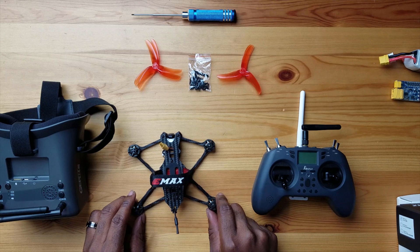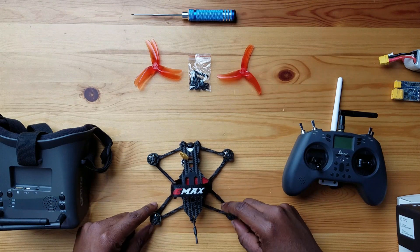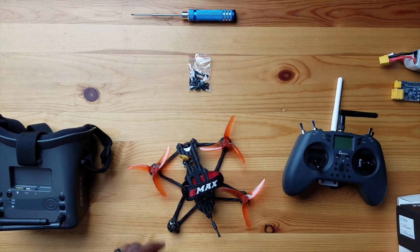Back from the computer at the desk — drone, goggles, and radio are all set up. Setup was pretty simple with some gotchas, and the VTX threw me for a loop. I'll look at that shortly. Now for the props — as you saw in Betaflight these are a props-in configuration, so the motors spin inward toward the frame. Setting all four propellers up for that now — front-left inward, front-right inward, rear-left inward, rear-right inward. We need eight screws total.